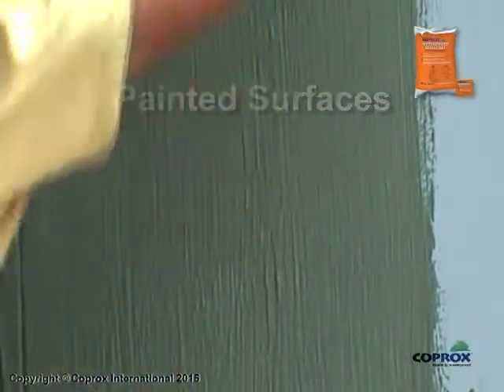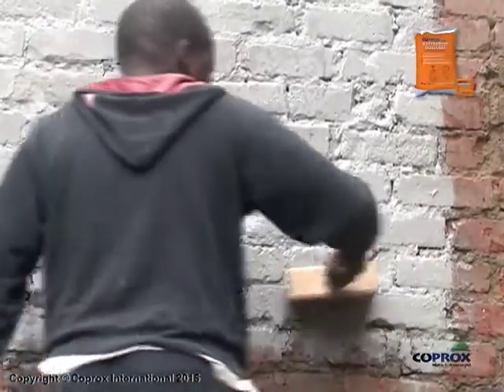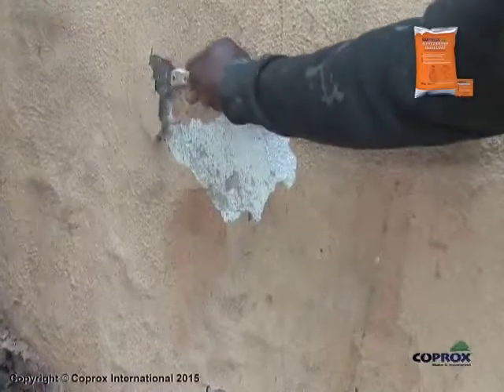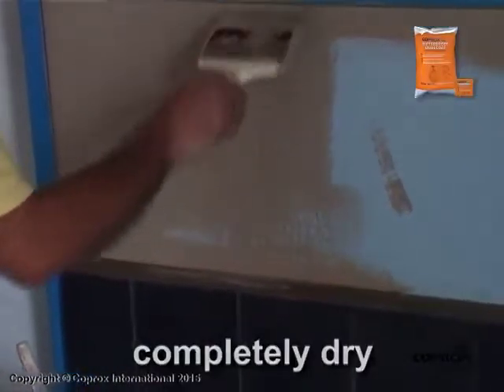Painted Surfaces: The surface should be a good quality paint. As with masonry surfaces, ensure no negative moisture is present. If negative moisture is present, then the surfaces must be treated in the same manner as required for masonry surfaces. Remove any loose or peeling paint. High gloss and enamel paints should be sanded. Painted surfaces must be completely dry before application commences.